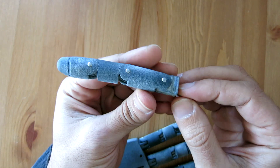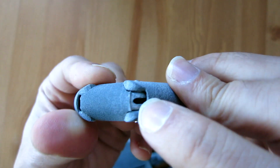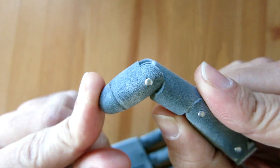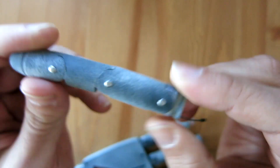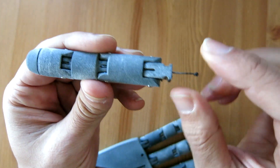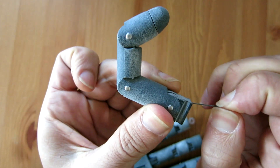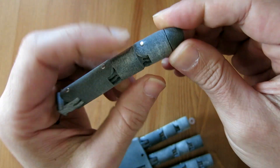What we're looking at here is a sub-assembly of one of the fingers — it's an artificial tendon driven unit. In the back there you can see a little elastic rope that returns the finger to the extended position when there's no load on it. So if one of the joints is bent and then released, it pops back. Down the front channel of the finger is a small rope which I'm using as an artificial tendon, and when that's tensioned by pulling it or a motor, it contracts.